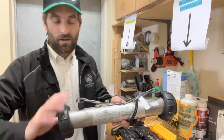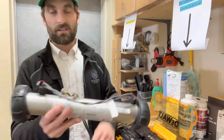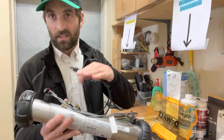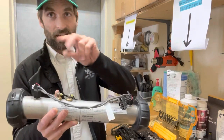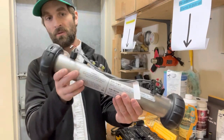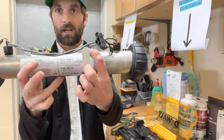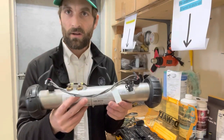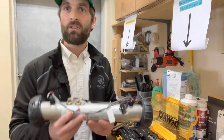Plug your element back into the circuit board — in this case it's just a plug. Some of them have copper leads, so just pay attention to those and make sure you protect the studs if you're having to tighten anything by hand or with a tool. And that's it. Because this one was removed from the box, I would re-secure it to the box with the two nuts on top and the bottom — there should be brackets in the box to hold them. And that is how you change an element in your heater assembly.